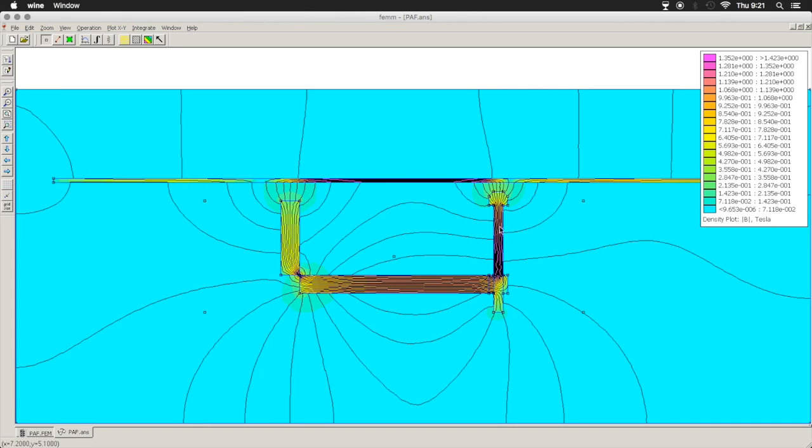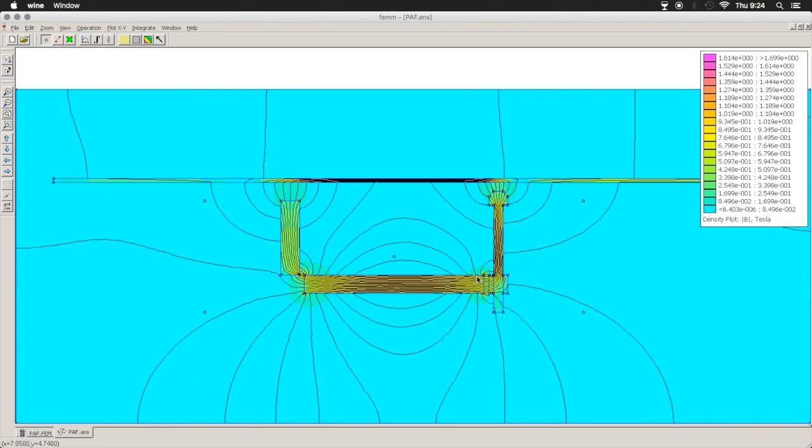We can see that our screw side, since we have less metal going on here in the core, is basically saturated by the magnet. We have the lines of flux around the magnet. And then we have our lines of flux going up through the slugs, which is far less saturated because there's A, more material, and B, they're more loosely coupled. So all these parameters are going to affect the ultimate sound of the pickup.